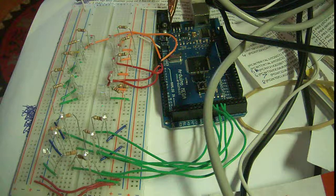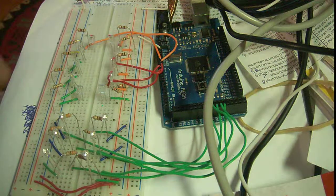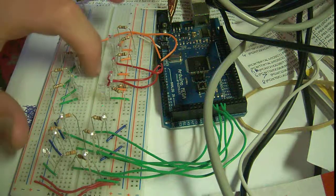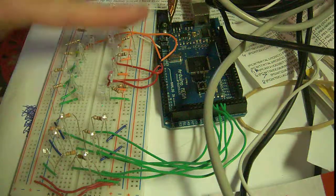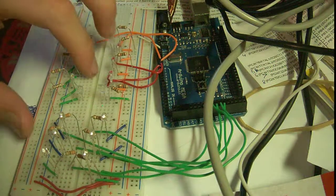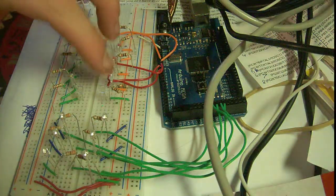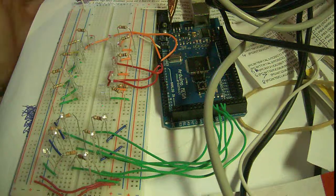It was pretty simple to do code-wise. Obviously, the code will still be on the website. All you do is you have some emitters, and you put the emitters at max power. In this case, these can handle 50 milliamps, and the only resistors I had could do 46, so these emitters are all running at 46 milliamps. You want to get the narrowest beam emitters that you can — the closer to laser-like they are, the better. Because that way, when you break one beam, instead of projecting a field to all three receivers, it only projects to this one, so the readings on the other two wouldn't change. That would be ideal.